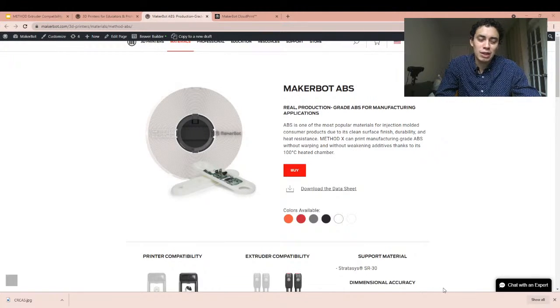it's one of the most commonly injection molded polymers out there because it's particularly strong, particularly stable, has good resistance to UV light, and overall good chemical stability. That makes it great for extrusion processes and injection molding processes. And in the case of 3D printing, well, extrusion is essentially what you're doing, right? You're extruding that filament layer by layer and forming a shape.